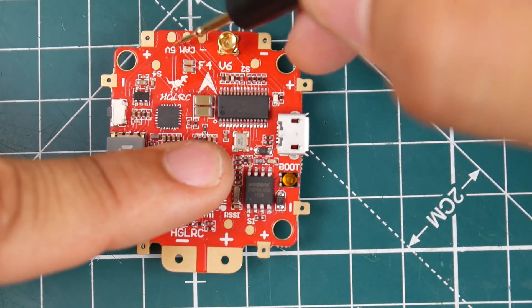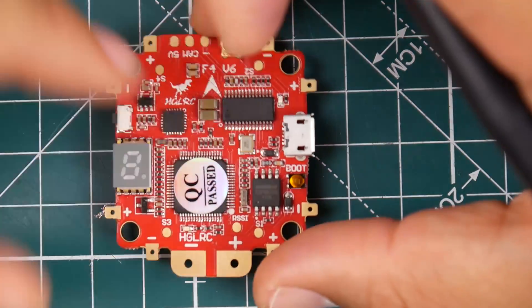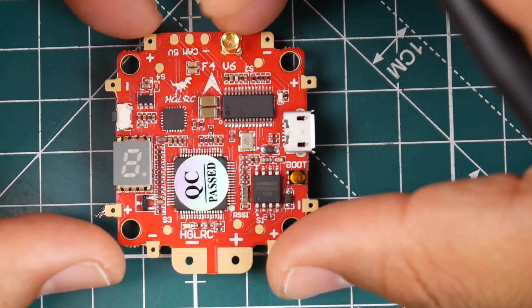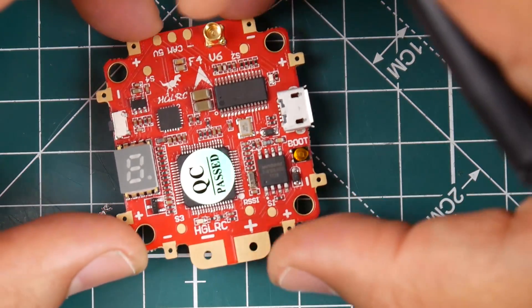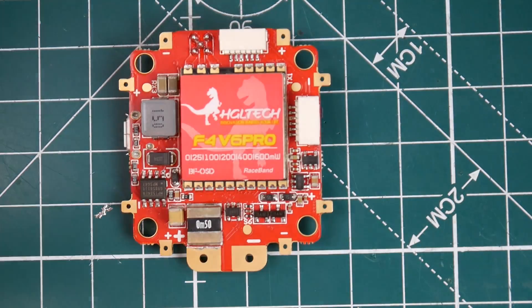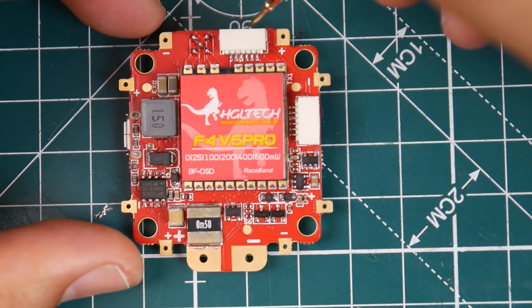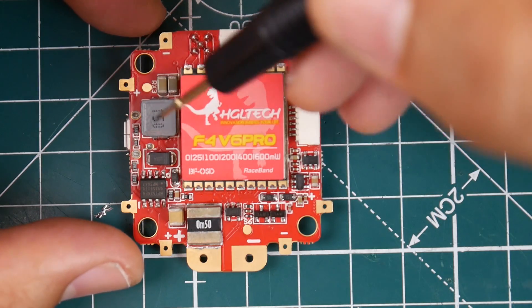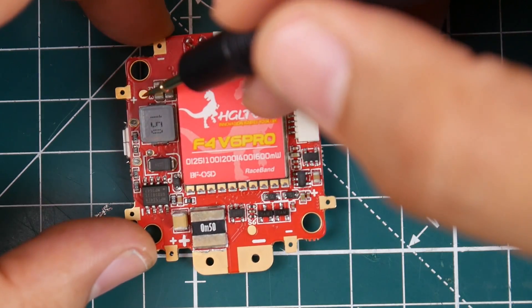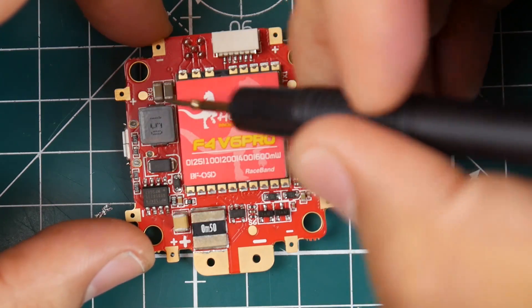If we take a look at the camera connection, this is where you'd want to install your camera — very simple, basic five volt regulator. However, this is where it gets kind of annoying. If you're going to be connecting iBus, it's going to be super simple, but you have to connect it on the backside. You could connect through one of the connectors, but personally I would put iBus on the RX3 pad and that's on the bottom. So yeah, that's kind of annoying.